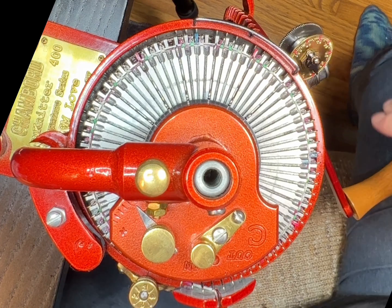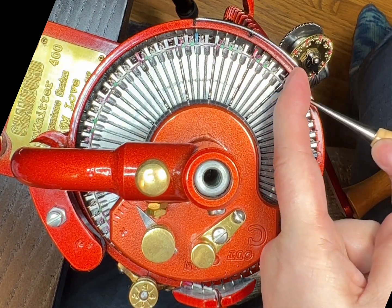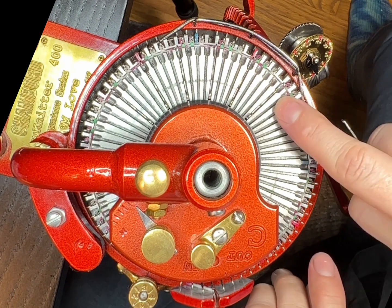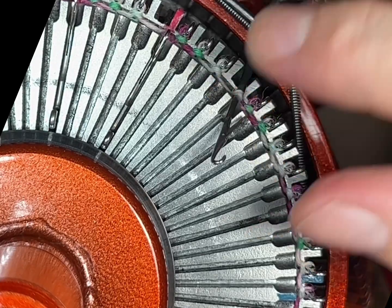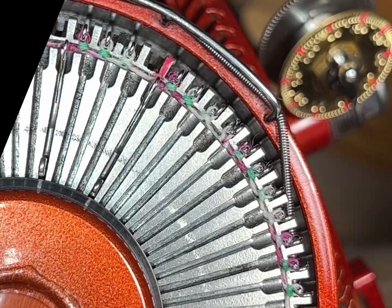All right, so we've stopped at 6 o'clock. Now I'm pointing to where the first ribber needle is. Put your cylinder spring on the rest, let it do your work for you, and now you're going to transfer every remaining last few ribber needles from the ribber needle to the stitch to the cylinder needle. Very easy. And then just make sure it's placed back in its little slot.